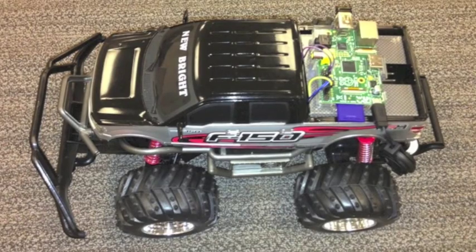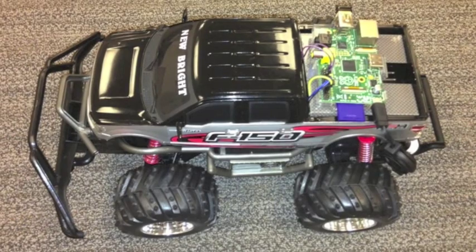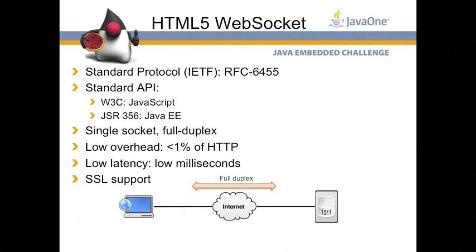Here is the Pi a little closer. So how is this all working? We took the Pi, we put Wheezy on it, we put the Oracle JVM, and we used Pi4J to access the general purpose input output pins. Primarily we are sending data to the truck, but there is nothing that would prevent us from getting data back as well. One thing we've been thinking about is adding a camera module so we can see on the remote control where the truck is going.